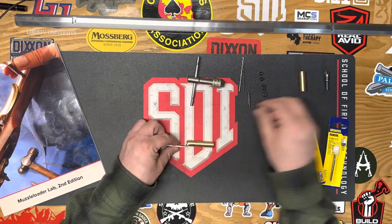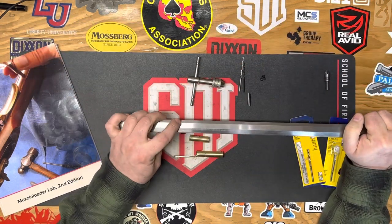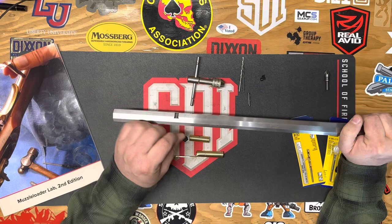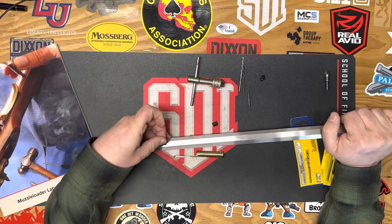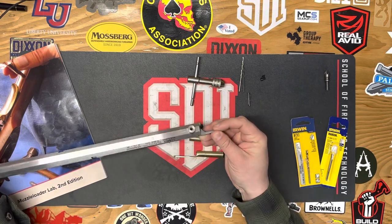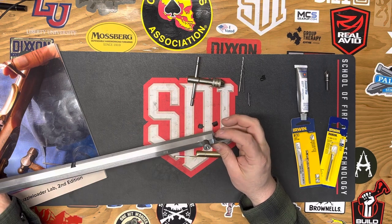This week we're going to focus on the rear thimble, the front thimble, and these barrel tenons. These are the tenons here — they get installed into these dovetail grooves at the bottom of the barrel, so they'll slide in there. The problem is these are rough cast and the barrel is machined, so we may have to file these to get them to slide in nicely.